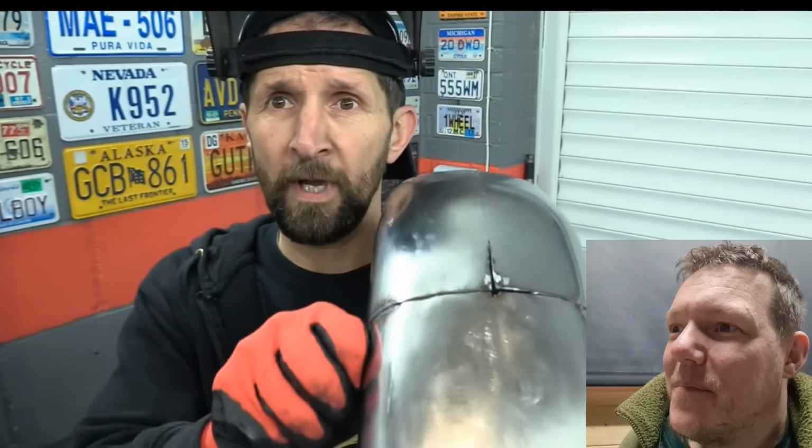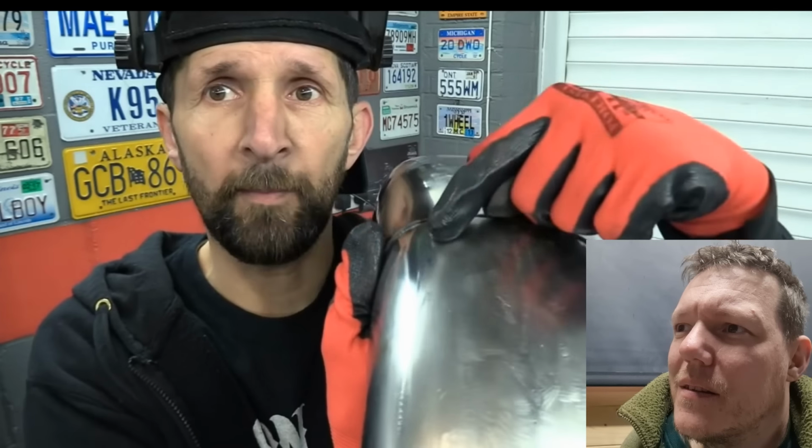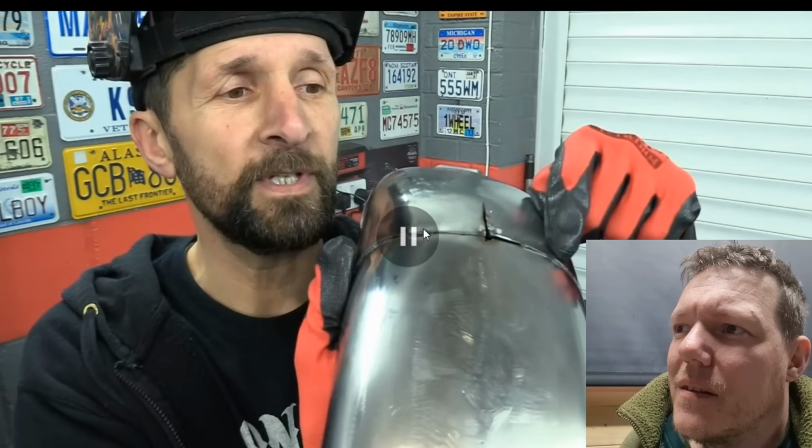Oh. Right, so this is where we are now. Weld the sides first, and then I've got that curvature absolutely correct and strong. A good little stack of tack welds on the inside to get it nice and beefy. Then that left a bit more of a loop on this back half than that half. This is why it's a bit flatter across the top than that is, but that's easy to remedy.